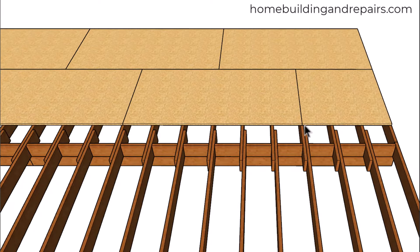And of course you can see where we're going to have a problem right here. If we break it on this joist here, we move it over four feet and this joist isn't long enough, then we're going to need to simply add an extender board. And you can add the extender board over here or over here.